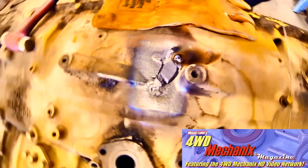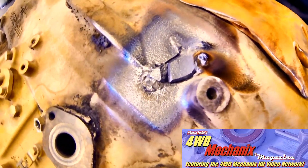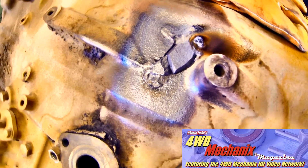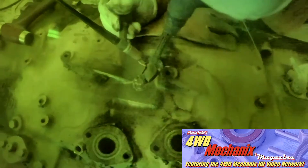Trying to put some in the bottom and let it solidify a little bit before adding more. Weld Mold 700 is a commercially pure nickel weld deposit. It can easily be machined, drilled, tapped, and filed. The procedure for using Weld Mold Company's 700 cast iron rod is to prepare the weld area by beveling and cleaning the cracked edges to be joined. You can use poly chamfer electrodes for all beveling applications.